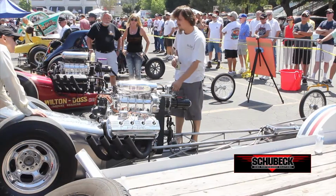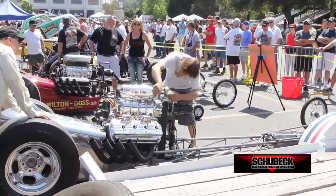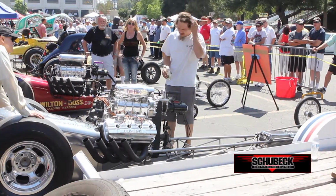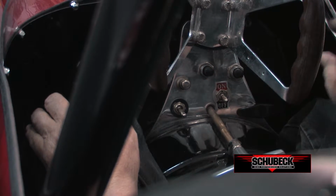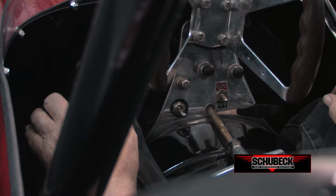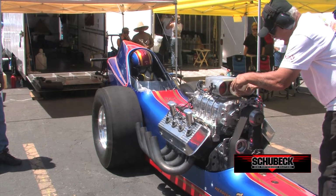You won't see a crewman with a primer bottle squirting starter fluid into the injector as part of the starting process, because the second middle button activates an electric pump that draws from a small onboard alcohol supply tank. This action sends alky up through the clear hose into the injector. A 3-second button push equates to approximately 3 squirts from the squeeze bottle.